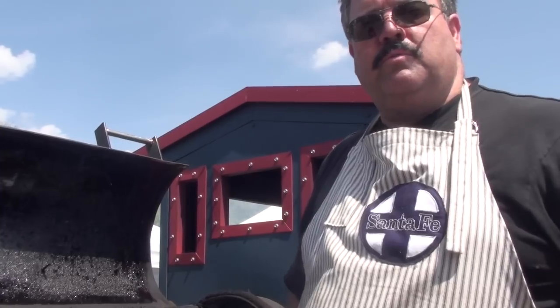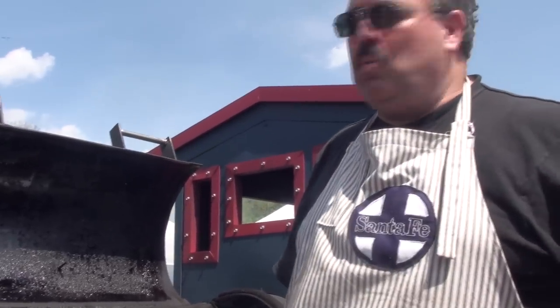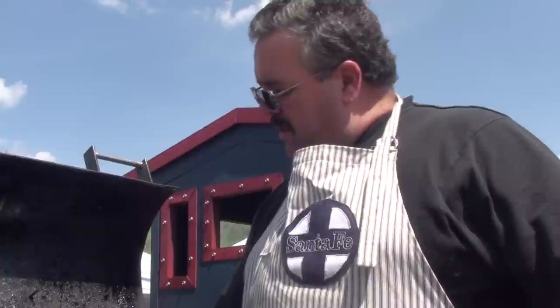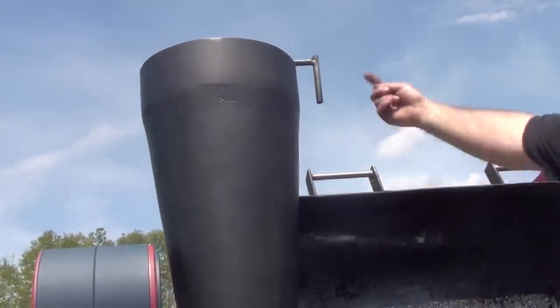That was the hardest part, pulling it apart and welding it back together. It was a ton of work. Yeah. This was the inner part of the tank. The tank actually had an insulation lining in it, and it had an inner tank that stored the liquid oxygen, and so I pulled the inner tank out and used that for the firebox. And then cut one of them up and made sort of like orange peel slices, if you could imagine it, and welded the seams together.